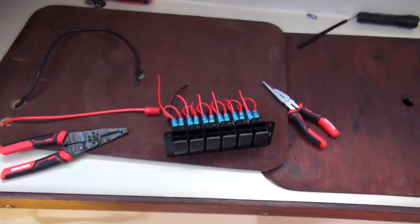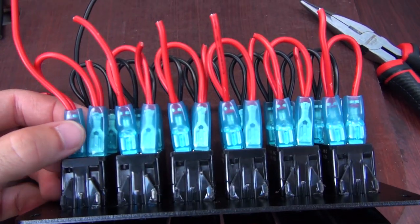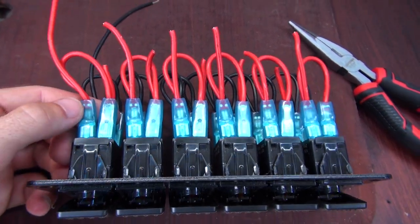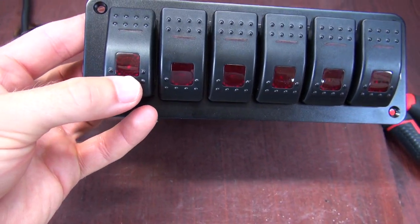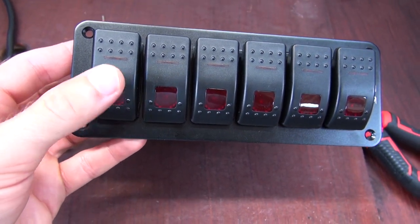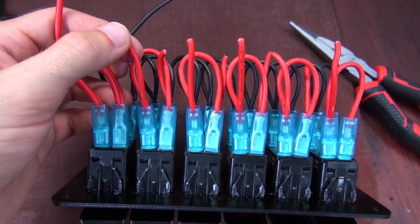We're about three hours now into day number three and as I thought this is turning into quite a complicated project. I ran the wires through the hull from the battery - the 12 volt leads. Now I've started the process of modifying the rocker switch panel. It turns out that interestingly enough the positive leads here not only control the power through the switch but also the lights - one controls the light down here and one controls the light up there, and also acts as the main one that pushes power through once the switch is flipped.